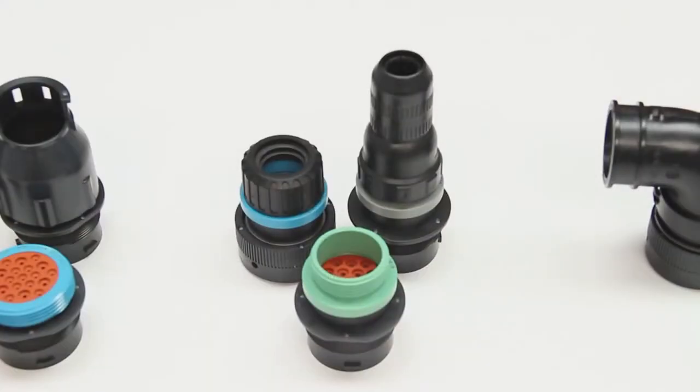The second modification is the L015 threaded adapter, which is available on size 24 shells. It accepts screw-on straight back shells that accept convoluted tubing or provide strain relief with a compression nut.